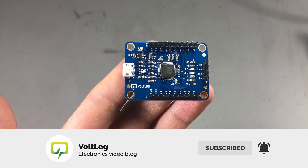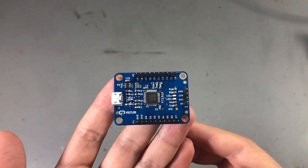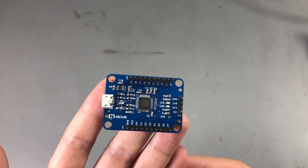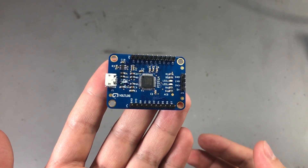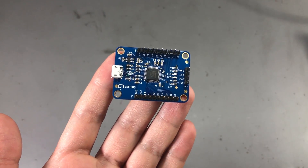This particular chip from FTDI has the built-in multi-protocol synchronous serial engine — MPSSE for short — which allows you to run a variety of synchronous serial protocols like JTAG, I2C, SPI, or just simple bit banging of the available IOs. You can imagine it can be really useful to be able to interface with a sensor over I2C or SPI straight from your computer over USB through this interface.